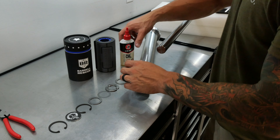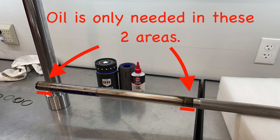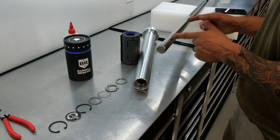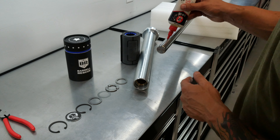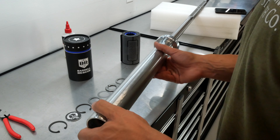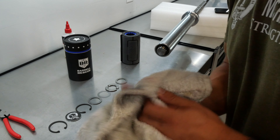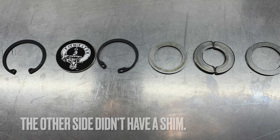I'll show you some B-roll pictures of the exact areas I'm talking about. You can see where the bushings were riding before, and those are the only two areas that require lubrication. Go inside your sleeve and wipe off the old oil, best you can, and wipe off the oil that's inside that one too. Your sleeve is clean and your shaft is cleaned off. Now you want to apply a little bit of oil only to the two areas that those bushings are going to ride on. There's no point in lubricating the entire shaft because there are no bushings in those other areas — just put your oil where you're going to find your bushings.